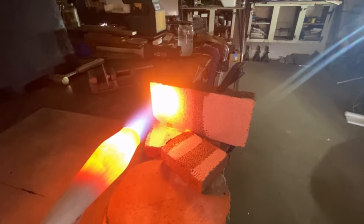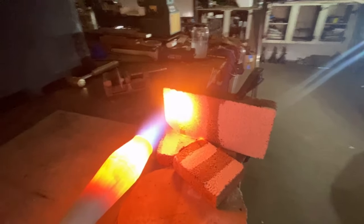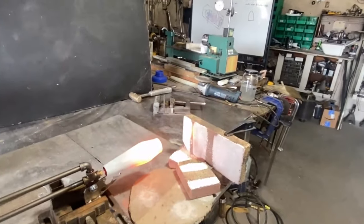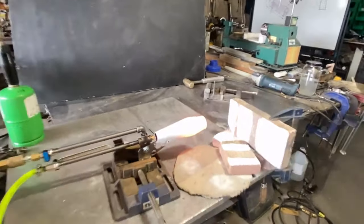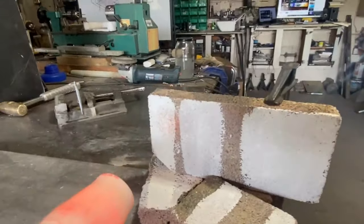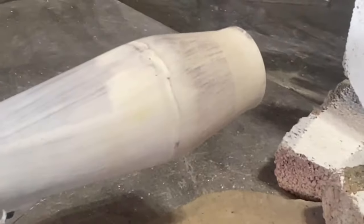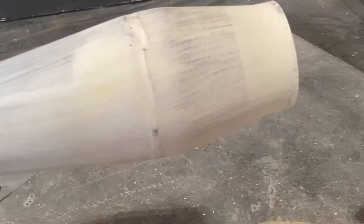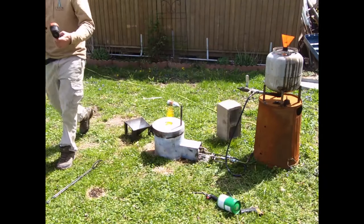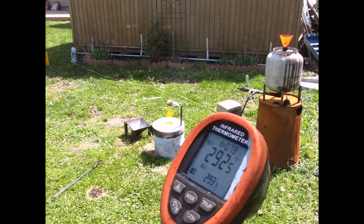Just a quick recap — this is one of the first tests we did with the high-temperature ceramic coating and the stuff performed phenomenal. But this is a very thin coat recipe; you can't go over a couple of mils. On stone it doesn't matter, you can go fairly thick, but even then it still has some spalling issues. It survived this test amazingly, which led me to go ahead and line a furnace with this high-emissivity coating.